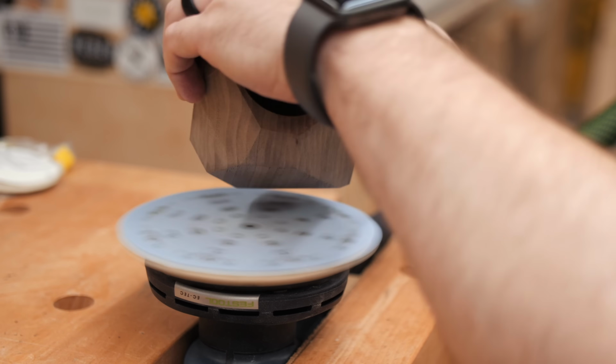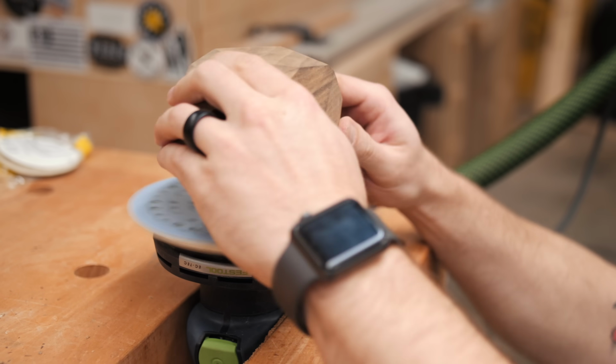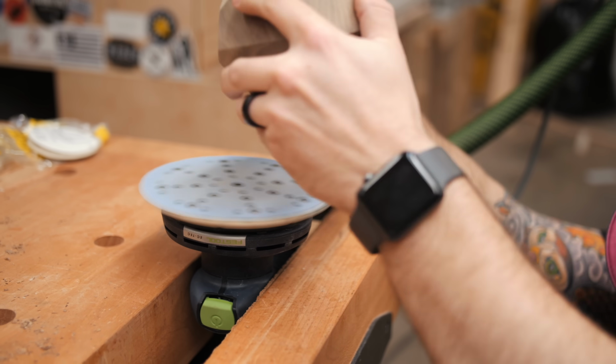After turning, I dried the piece, again using the same microwave method, and got it down from 400 grams to 300 grams over the same weekend round of drying. After drying, I sanded the piece using a combination of the oscillating belt sander and random orbit sander.